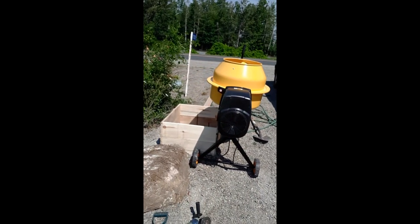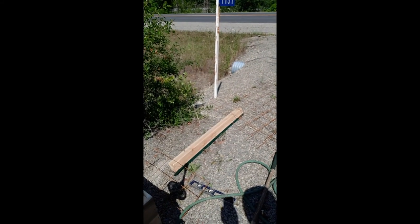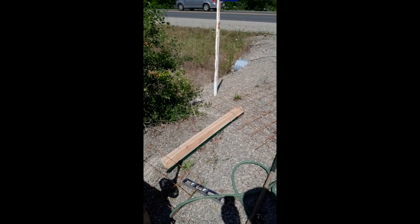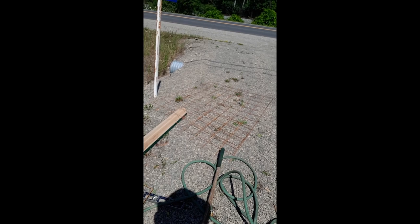For the gateway post I've got a 4x4 cedar — yes, I'm setting it in cement, it's an inexpensive option. I've got wire mesh cut up and ready to go, roughly 18 inches by 26 inches, to go in the hole. I also reinforced the four-foot cedar with t-bar. I'm going to get this thing started and see how this city slicker gets on with putting it all together.